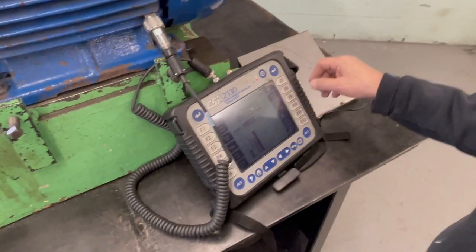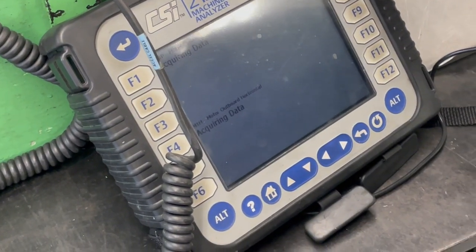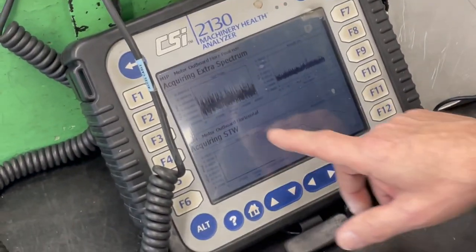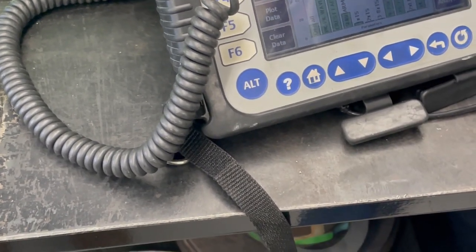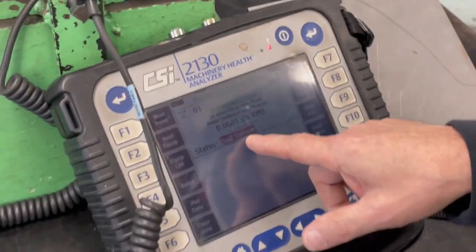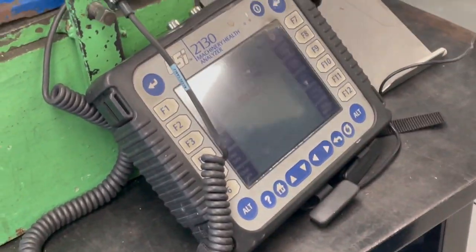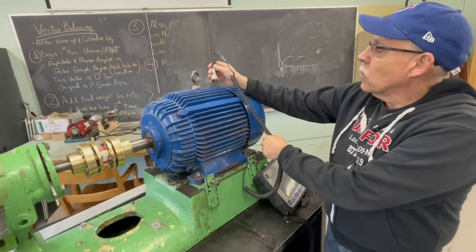As soon as you see a ski slope, you know you didn't give it the right settling time. Delete it — you can go on the box and delete a reading. It'll ask 'do you want to delete this sensor improperly?' — it actually detects bad sensor placement and lets you delete the reading. If the sensor isn't hooked up or there wasn't enough settling time, the box will say 'bad sensor' and show you the ski slope. Delete the data, take another reading with proper settling time.